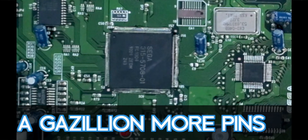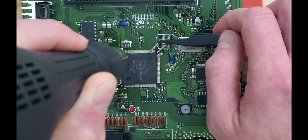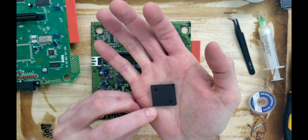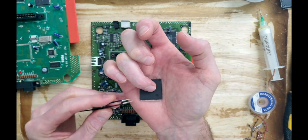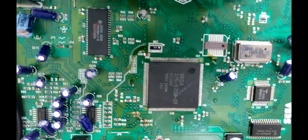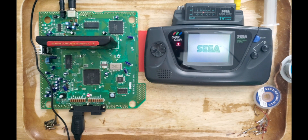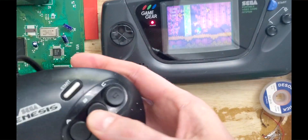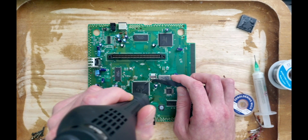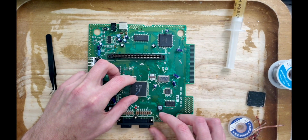In the end, I managed to remove the ASICs with some minor bruises. Bending these pins manually by eye is a royal pain. After installing our suspect ASIC onto our known good board, our suspicions have been confirmed — the exact same issue as the first. The A and B buttons are not working while C and start remain unscathed. At this point the mystery had been revealed, and I had no desire to fix the original Genesis that I had butchered and battered.